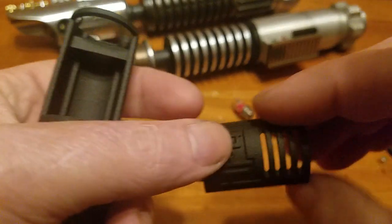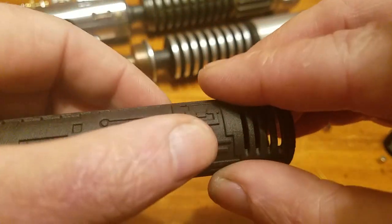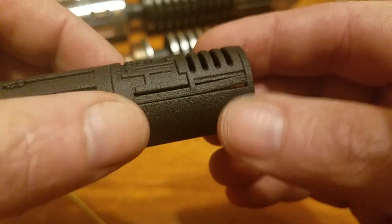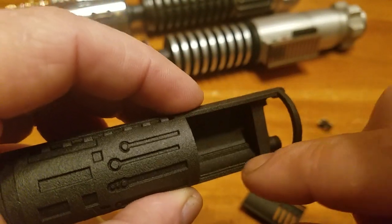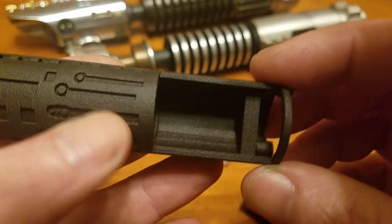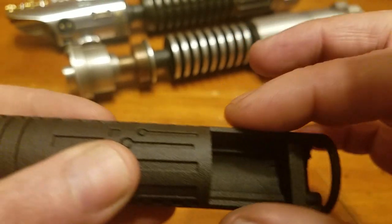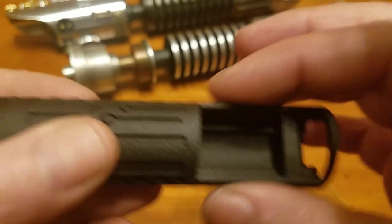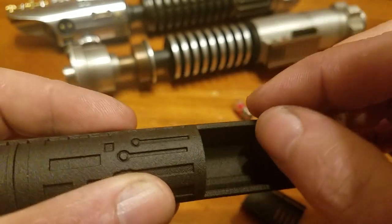On the cover, I've found that I sometimes have to sand a little bit depending on the print you get, but sometimes you might have to. This one fits pretty well. As far as setting the board in, it's snug — you'll usually have to sand the edges of the board, and you might also have to clear out a little bit inside. It depends on the print. Shapeways isn't always perfect but they are pretty good. If you don't do this, you'll end up with a little bulge that causes trouble. It's easier to sand the board and clean out the slot before your install.